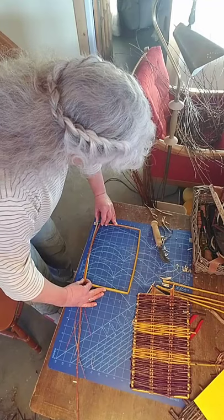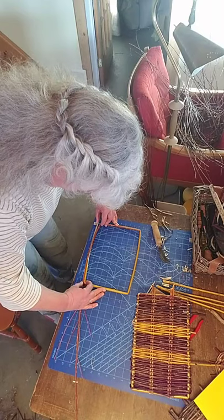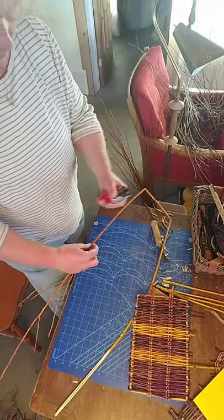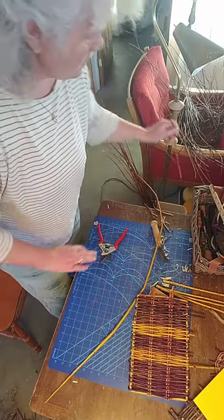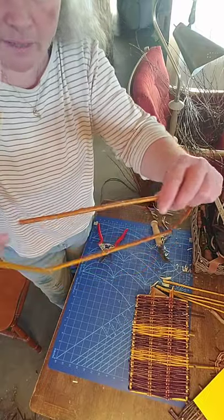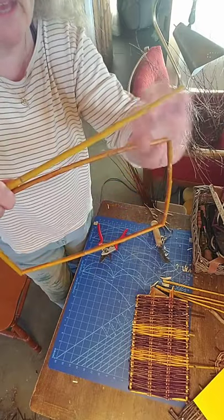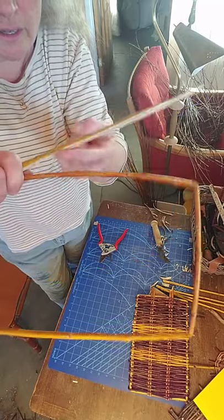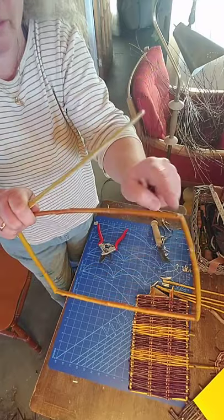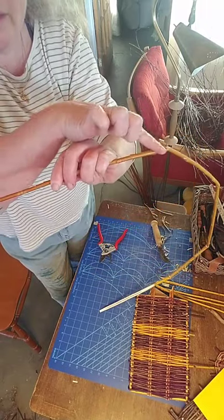It helps me make everything square. So this will have to come in for a bit — I'm now going to cut right here. This is for the fireplace. So now I have my thick end and my thin end. The thin end is going to go underneath, and it now needs to be tapered on the outside of it so that it matches the cut we did on the inside of the butt end. Now I'm going to start from here and thin it down to very thin at this end. Thick and thin — this is the thin side.